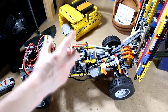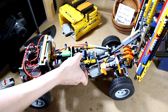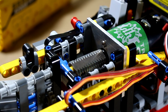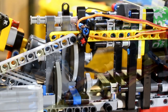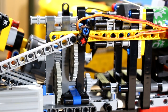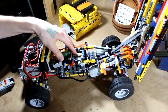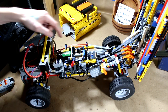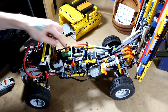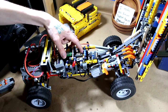This motor setup has some aluminum plate here — an adapter and a drive adapter that I had to make so I could adapt from the motor shaft to the Lego shafts. That was actually fun to make. I was able to use my dad's wood lathe — I just chucked a piece of all-thread in there because it was the biggest chunk of round stock we had at the time. I chucked it in, filed some flats for the set screws, so I have a set screw holding it to the motor shaft and a set screw holding it to the Lego shaft.